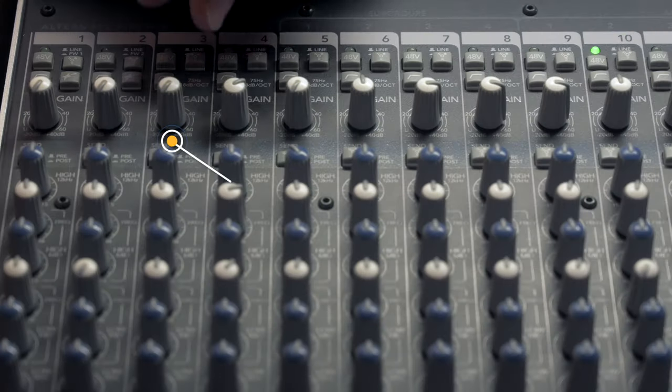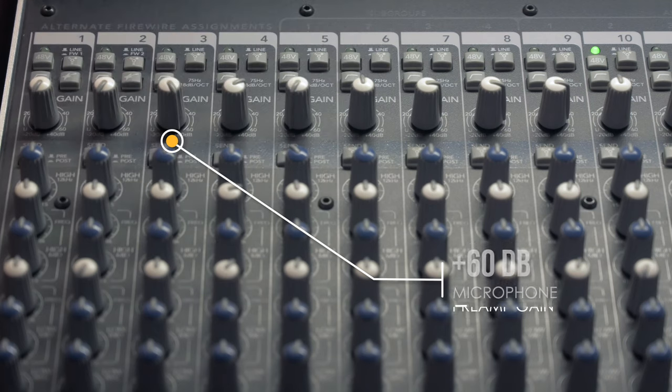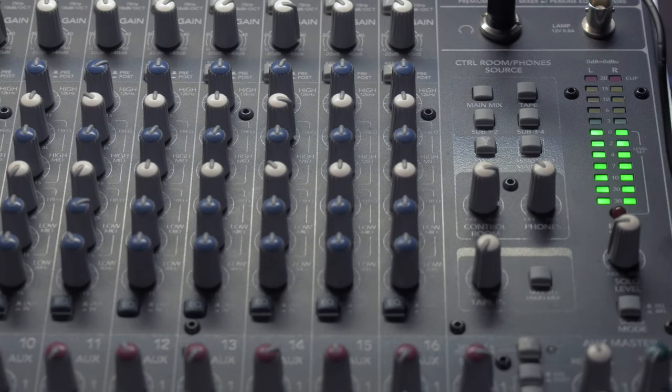First, we're going to make the connections to our mixer board, which has incredibly clean preamps and 60 dB of gain. But in order to achieve that, the gain knob has to be completely maxed out. Then we're going to check our level on our channel meters and then again on our main LEDs. Each track will be metered and recorded on the main LEDs here at the same level, with none of the additional mixer features engaged like the EQ, as we don't want that to play into any of our tests.